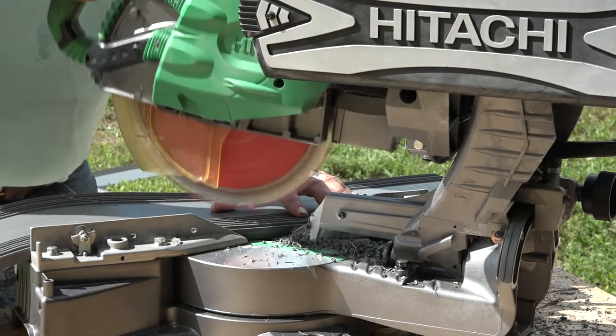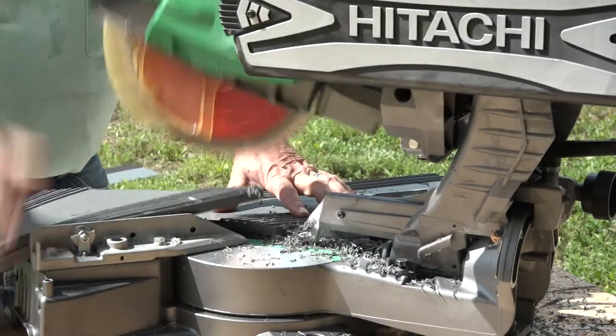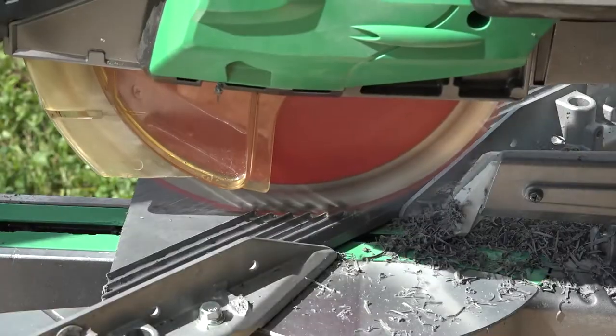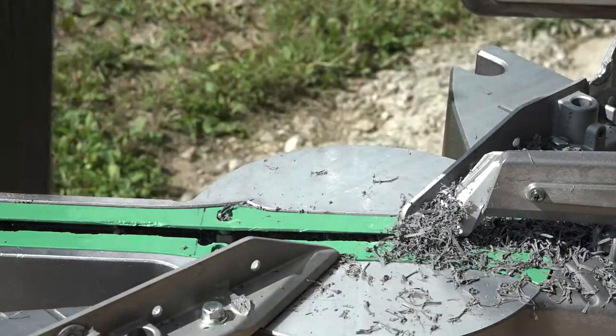Turning the lengths over, cut the prepared 45-degree cuts in half to create points. It is important to remember that for T-splices, one of the three 45-degree cut lengths should remain intact and not cut to a point.